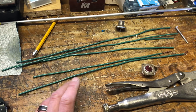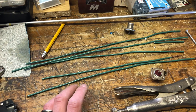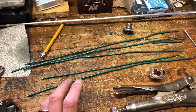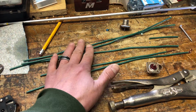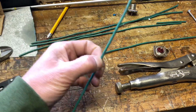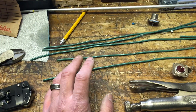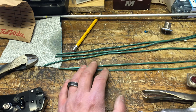In the description, I'm going to put a link to an antenna calculator that I use. You can plug in your frequency and it will give you all the dimensions you need for your ground radials and your driven element. The driven element is a little shorter; your ground radials are going to be a little longer, depending on the frequency. This is really good for building 2 meter, 70 centimeter, and 220 antennas.